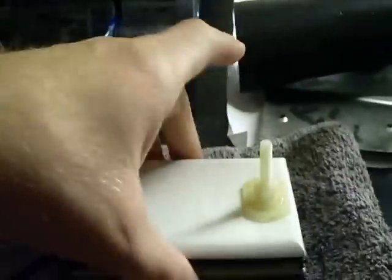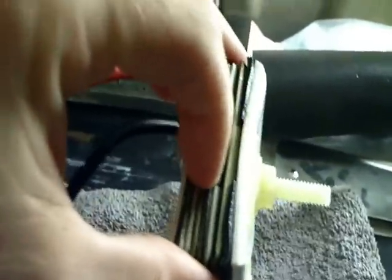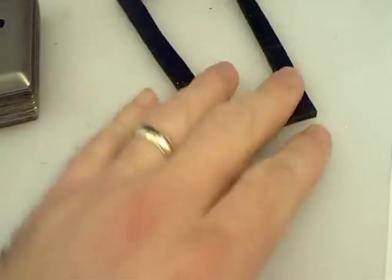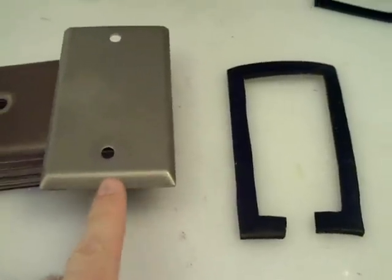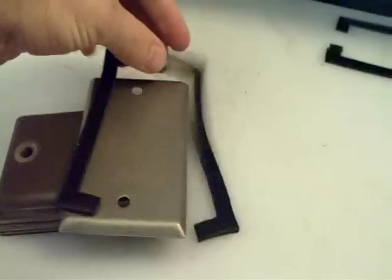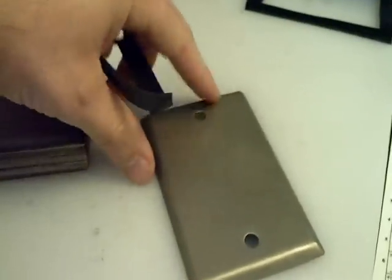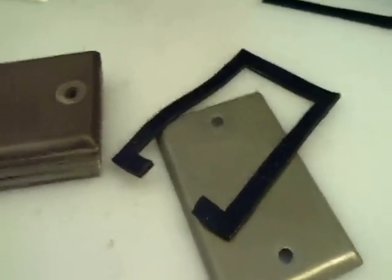It's a pretty small stack. Basically what I did is I cut out notches on the tops of the plates and then I put gaskets in between each plate so that way I forced all of the exhaust to come out through this hole. I cut a little piece out of the gaskets, and on the plates I cut a notch about the same size, using these as gaskets between each one of the plates. By doing that, I forced all of the gas from each plate to only come out of the top of the cell, essentially forcing all of the gas to combine in one area.